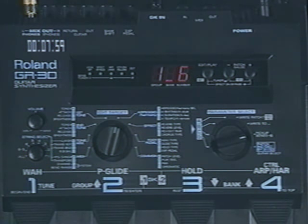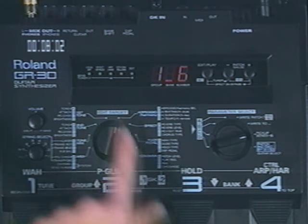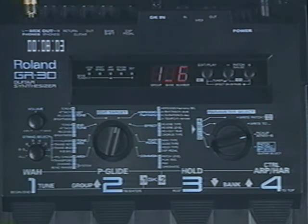You may also notice that on the left-hand side of the display, over here, the small LEDs are now functioning as a bar graph meter. If I play gently, I can light just the first couple of LEDs. As I increase my picking strength, the meter shows an increased deflection. Now, the idea is that when I'm playing the string as hard as I'm likely to at any stage, I just cause that little last LED to light. Now, if it turns red, it means you're probably just overshooting a little bit, which is exactly what I'm doing. So I need to reduce my string sensitivity just a little bit for the top E string.